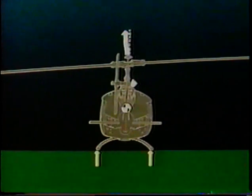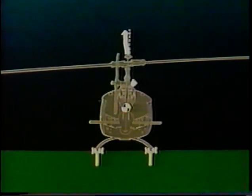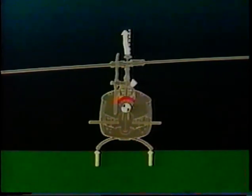With the aircraft on the ground, none of this can happen. When left cyclic is applied, skid friction with the ground or an obstacle sets up horizontal reaction forces that prevent the skids from moving left or right. The aircraft still wants to roll left due to left cyclic, and the CG still wants to align with that thrust direction. That is, move the fuselage toward the right, but it can't because of the skid friction. This impulse toward the right generates a rightward roll moment, not around the center of gravity, but around the right skid. And it is this event that sets up the conditions for right rollover if controls are improperly applied.